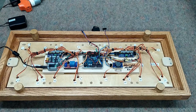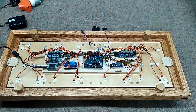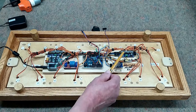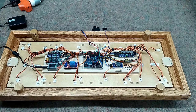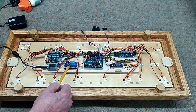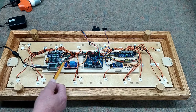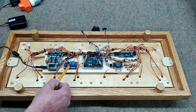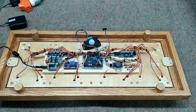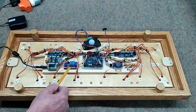When the clock goes to sleep, the Arduino, power supply, and clock module are all still powered up, and the circuit boards for the servo drivers are still powered up. But we have turned the power off to all 28 servos. The normal state for this relay is normally open, meaning the servos are not powered — which makes sense out in the shop where I might only be here for eight hours a day. When the infrared sensor detects someone in the shop, it turns power on to the servos, and that's the only time they're energized.